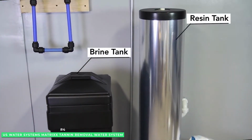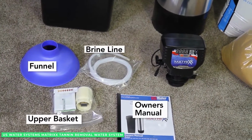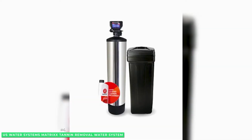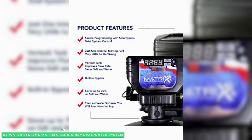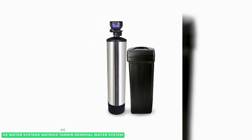Most filter systems, even if they're high-end, use a low-cost styrene-based resin that simply doesn't do the job. A filter using cheaper materials may not cost you any less to install, yet will only remove between 65 and 70% of tannins. The Matrixx Tannin Removal System uses salt to regenerate the anion resin.